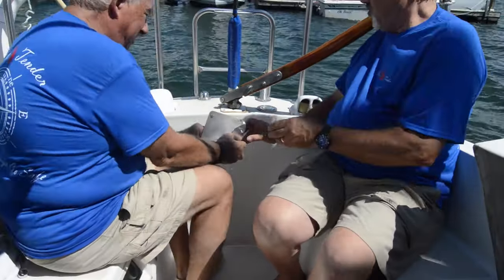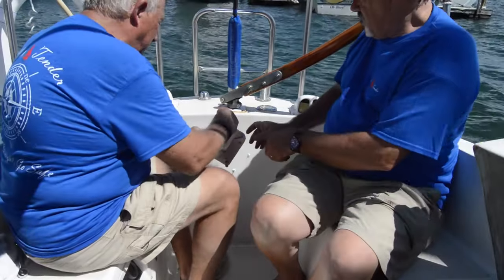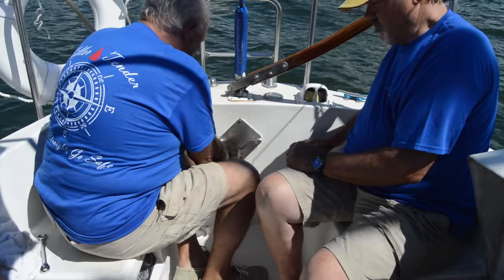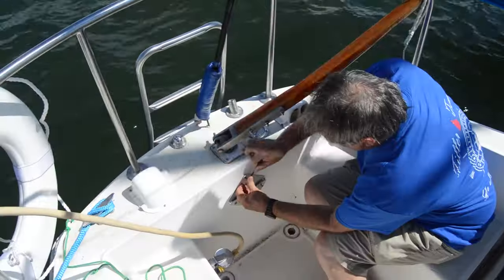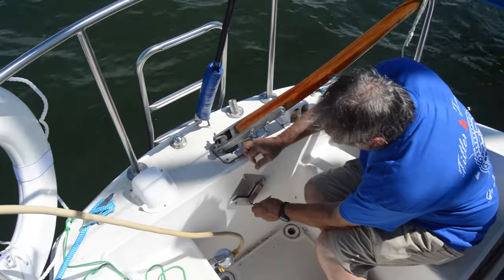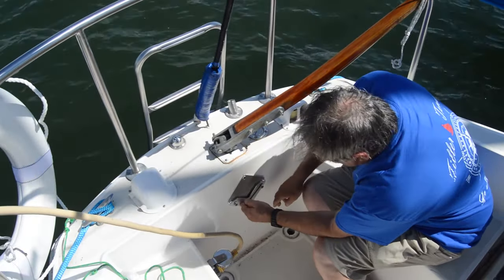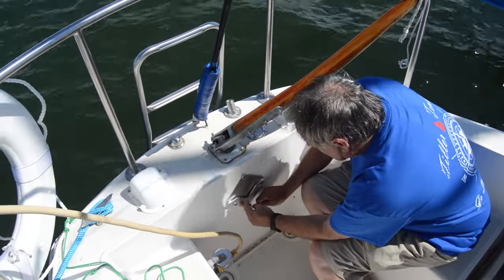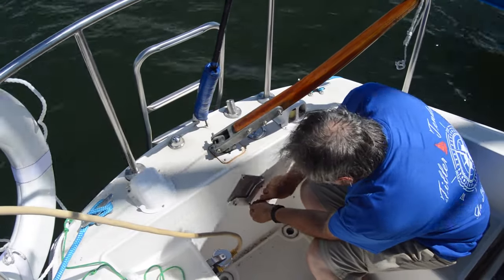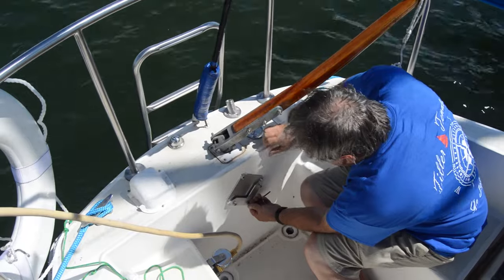Install the receiver onto the transom. Put the bolts into the receiver plate and insert in the holes in the cockpit wall. The smallest person goes below deck or reaches up under and places the backing plate on the screws, while the outside person manipulates the screws with a No. 4 Allen wrench until all of the screws are through the backing plate.